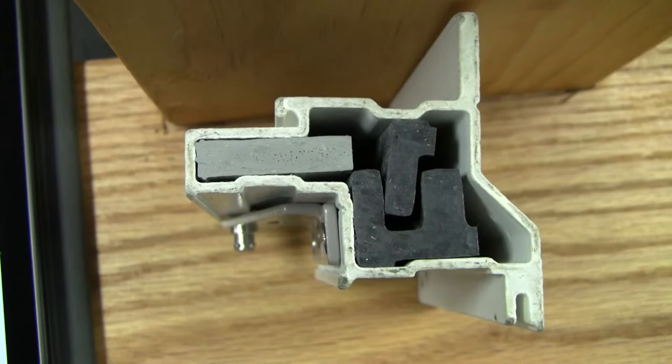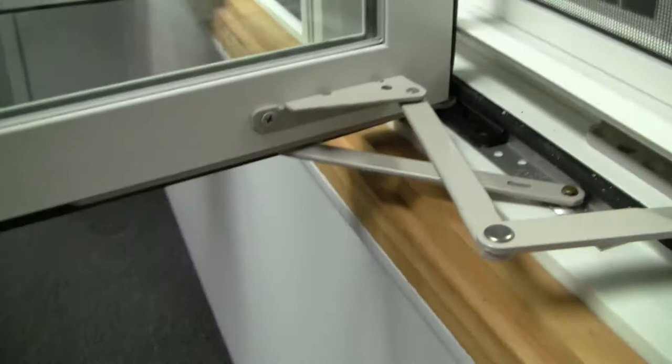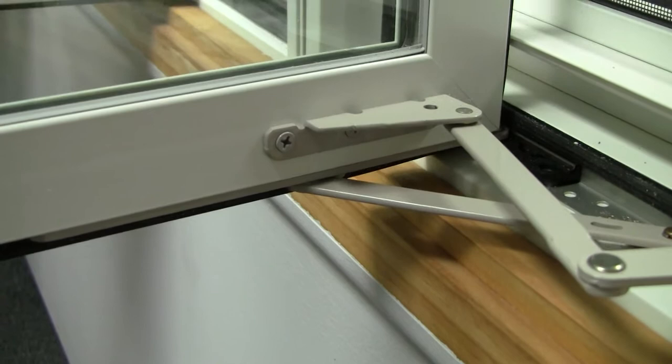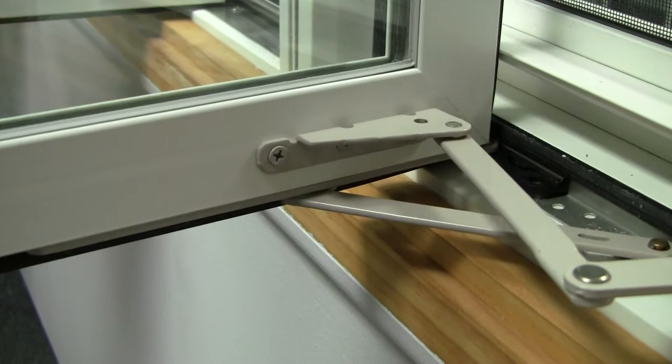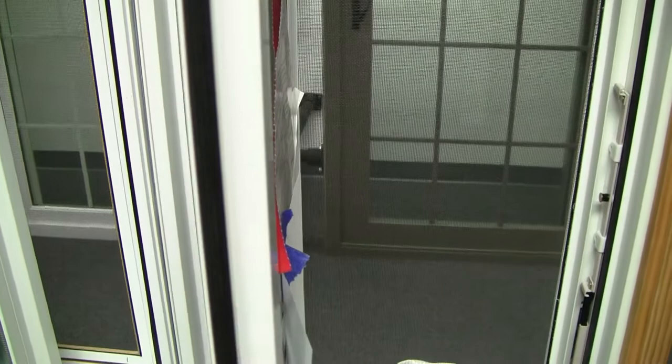So which one of these three windows has this system? Well, here you can see this hardware attaches to the side with three screws. It's not a good support structure because it's coming in from the side, and it looks aesthetically ugly. The window is white — well maybe you wanted it stained wood. Whatever color you want the inside of the window, wouldn't you rather see the color instead of ugly hardware? Also, this window only has one locking system and the sash is only one inch in depth, so it's not going to compete with the wall on much of a level.